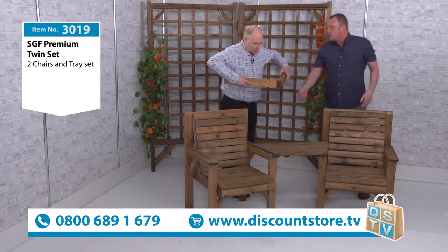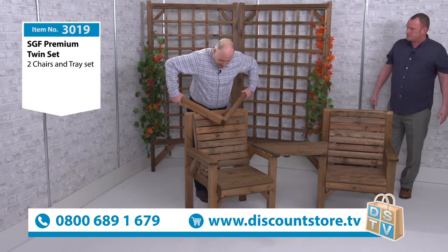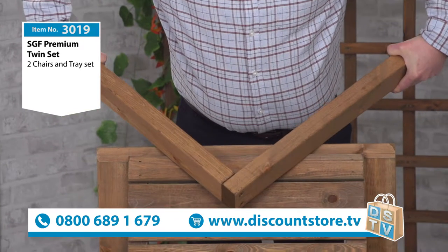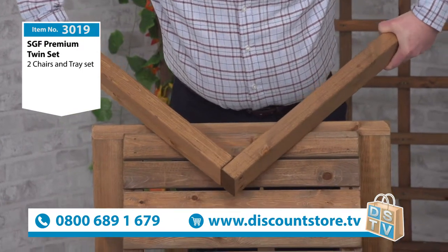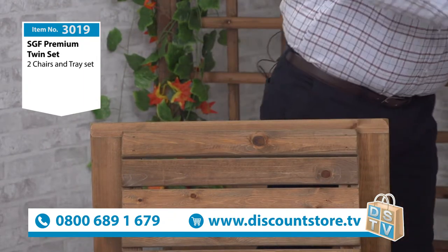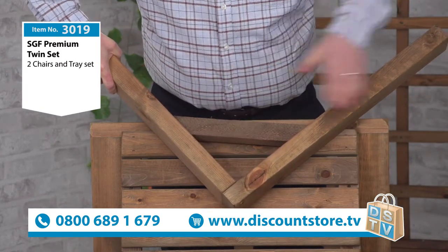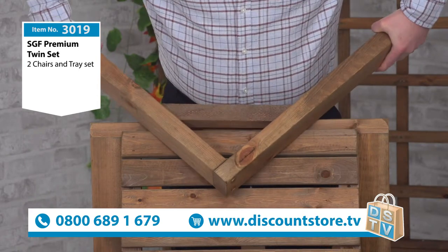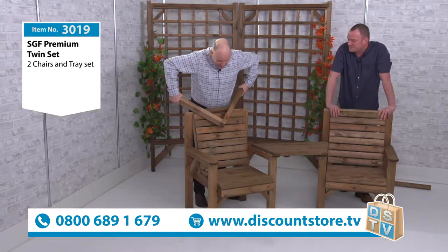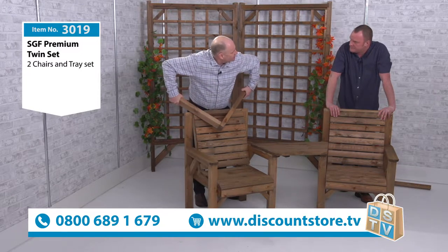So if I pass that over — yeah, give it a bit of a move. It's screwed in there but it's not braced, and there's real play there. That's with 80mm screws, two big screws in there, and there's still that amount of play. Now if you pass that back, I'll give you one that's actually been braced up. Go on, give it some! No — that is not happening, that is not moving at all. So you've got the big long screws in there, but it's that brace that makes the difference.